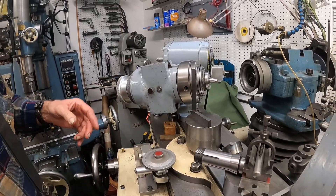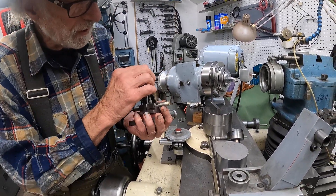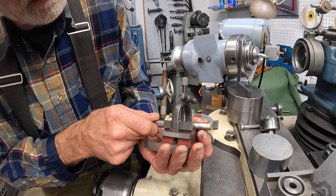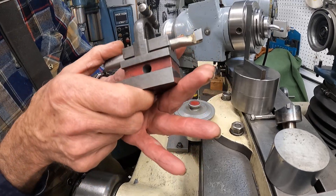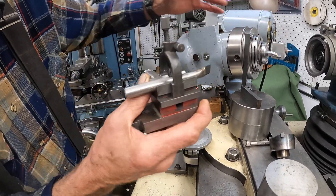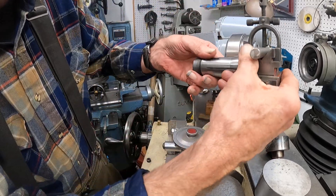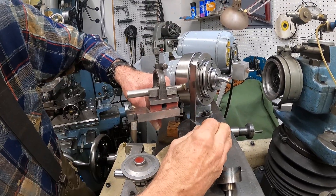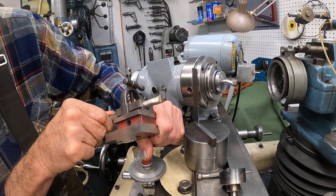You have to change the angle of the tool to suit the material. Sometimes you're working on very expensive things — I've certainly worked on things I can't afford myself and you don't want to screw them up. Here's a boring tool I made using carbide blanks brazed into a little shank. With the v-block here, I can grind the face of the tool more easily than leaving it in the collet, since I'd really have to jack the head around to grind the face. I pull the tool out, slip the v-block in, and you can see it faces into the wheel. I can set it up at angles with a square or protractor using the scales on the machine. That's how I grind my tools.